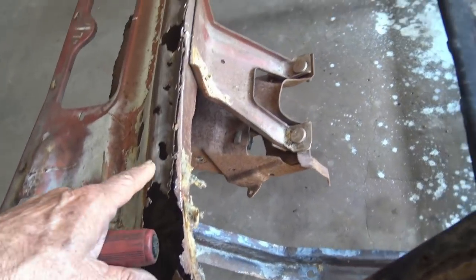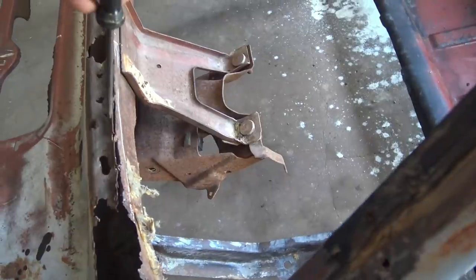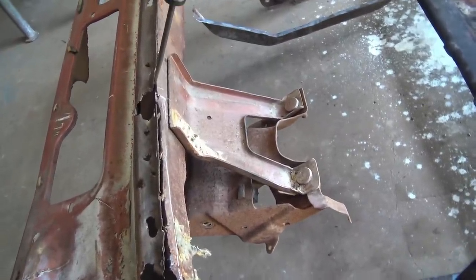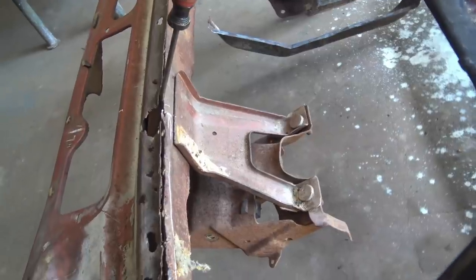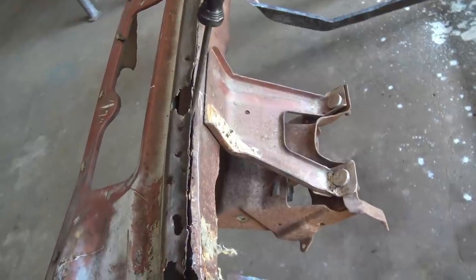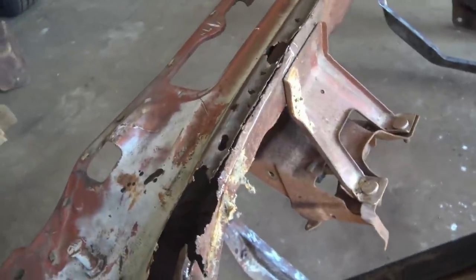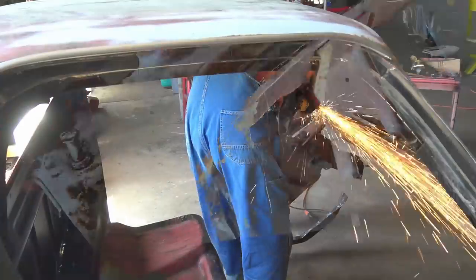Now the first thing I done is took the hammer and dolly to try to straighten the lip out some, and I made sure that these two pieces was already separated all the way down where I'm gonna cut, which is right there. Because if it was still welded together anywhere, I needed to do that before I cut this, so I got more strong support to beat on it. So, yeah. Okay, now I cut that piece out, go from there.